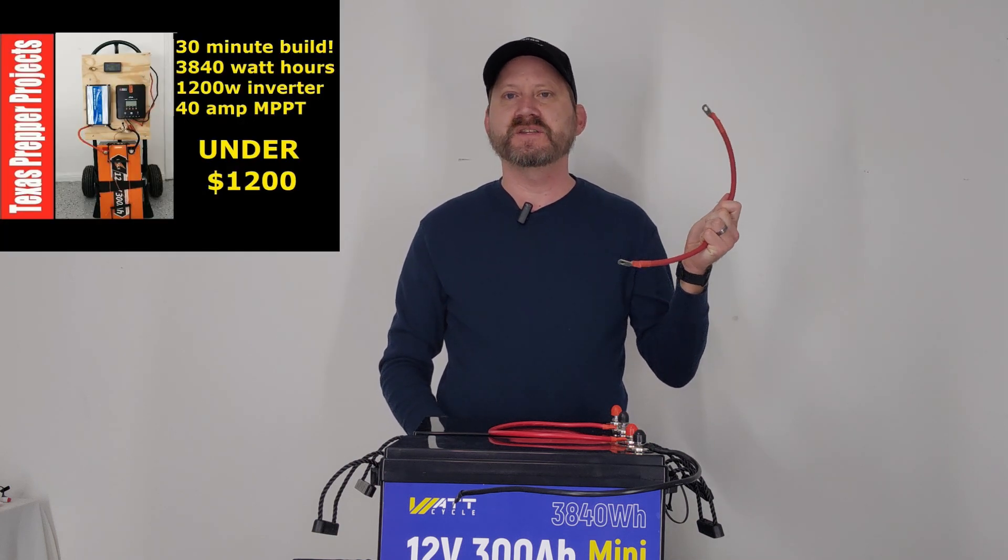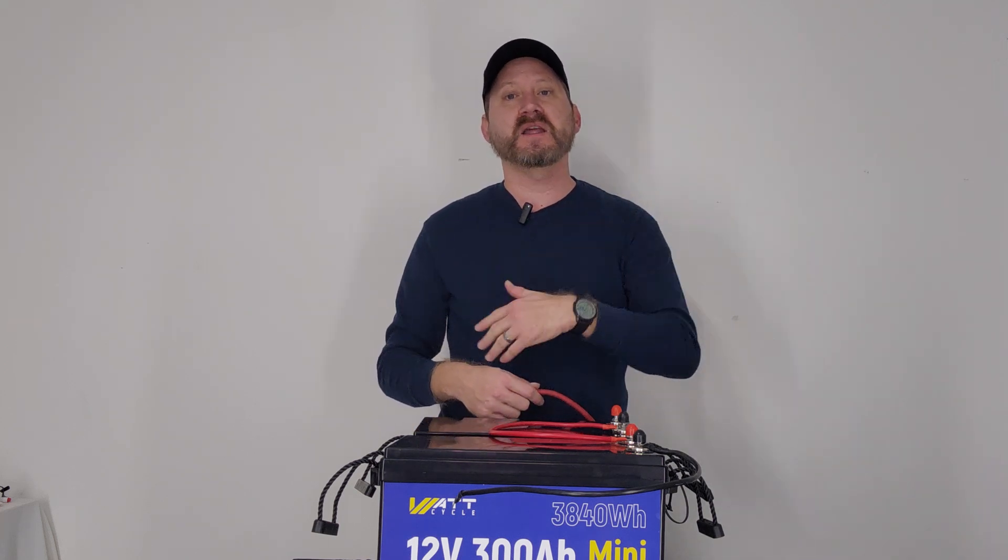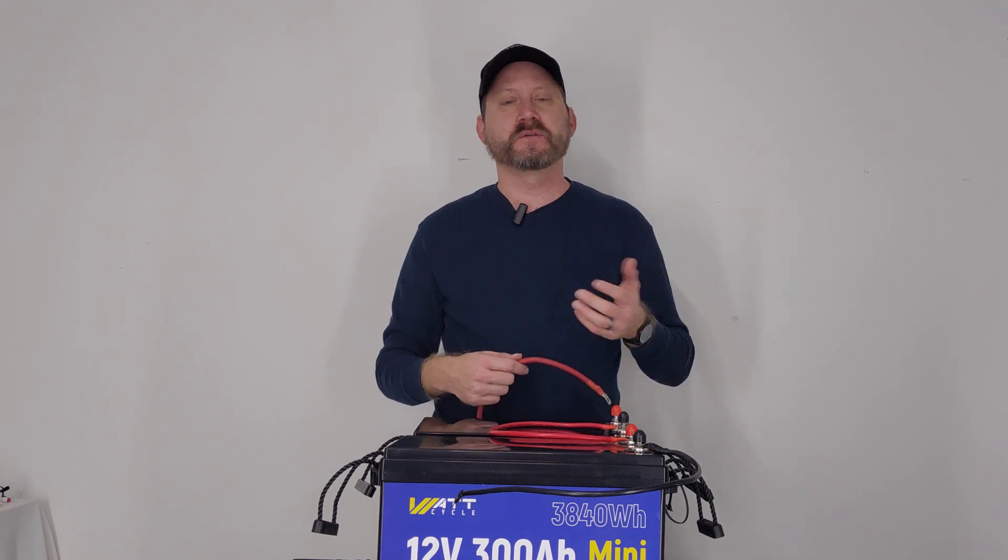The advantage to that is twofold. Number one, you can use smaller wire since your current is not so high. It also makes the system a little bit safer — at higher currents you're getting into overheating issues. In a previous video when I was doing a capacity test, my four-gauge wire was starting to get warm. By cutting the power in half I've increased the overall system safety without going to enormous size wires.